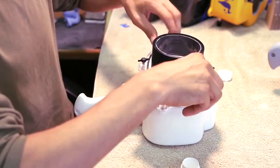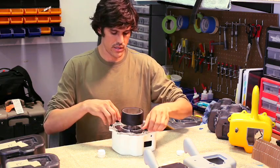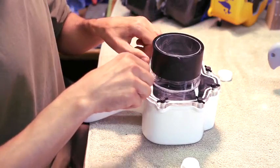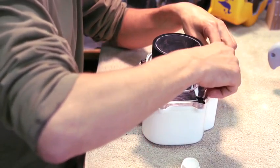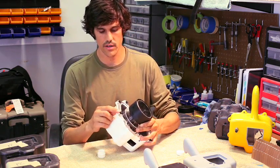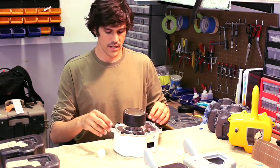We've got our 8 screws, and I'm going to start tightening them down, just so they begin to engage with the acrylic port. It's always good to have a towel underneath if you're at the beach or on the seat of your car or wherever you're putting your housing together. Okay, so now I've got all my screws not yet tight, but just to the point where the top of the thumb screw is touching the acrylic port. Now we've got all the screws set into place, and it's time to actually start compressing the O-ring.